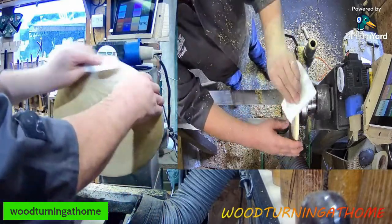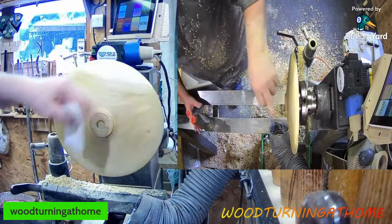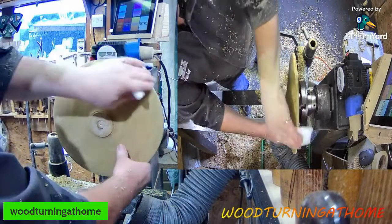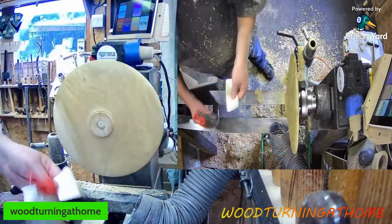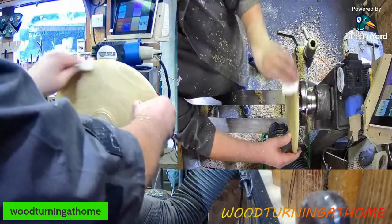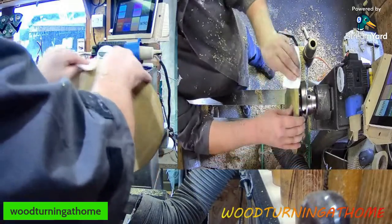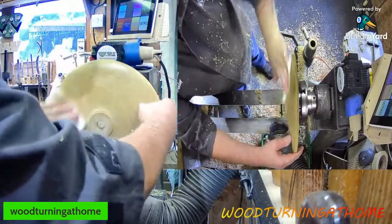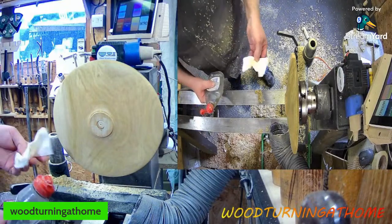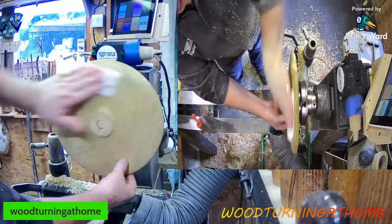Looks nice with that little bit of moisture put on it. And it's got a wee bit of grain at the side of there. That'd be cellulose sanding sealer you're using at the moment, yeah? Yeah, cellulose sanding sealer, Chestnut product. I mix it 50-50 with thinners. I mix mine 50-50 as well. Mine starts off at 60-40, but I use the Liberon, which is a little bit thicker. But then it's sort of guesswork down the rest of the pot. When it feels right. So, just give it a good coat. This is nice and dry and it'll soak in well.